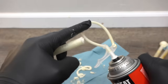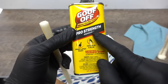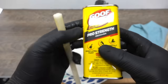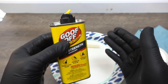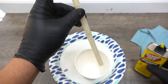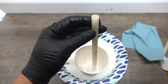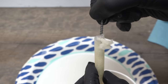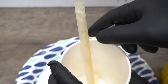So how do you clear something like this when the foam hardens inside the straw? For this tip, I'm going to use Goof Off — it's a remover for dried latex paint, adhesive, glue, asphalt, and tar — so we'll treat the hardened foam as an adhesive. For safety, please use latex gloves and wear safety glasses. Pour some Goof Off right on top and watch it dissolve through — you should immediately see it start cutting through. Squeeze it and work it in and it melts the foam into a mushy consistency.